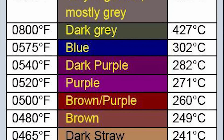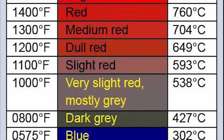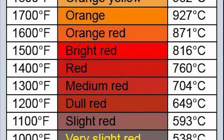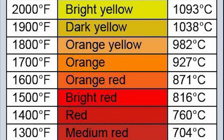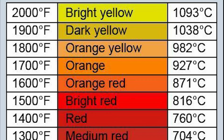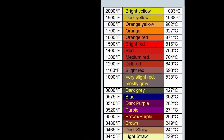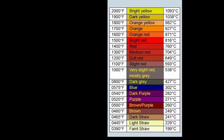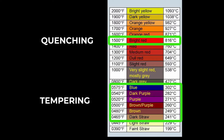Let's have a look at our color chart. This chart can be used to identify temperature ranges for heat treating carbon steel. When steel is heated, it will naturally go through a temperature change, which will reflect in different colors. Those pretty colors you see are not the different alloys — they're telling you something important. For this application, we want our material to be red for quenching and in the tan-to-blue range for tempering.